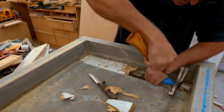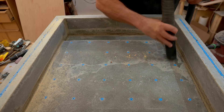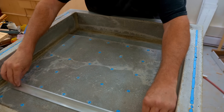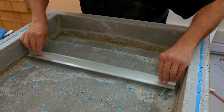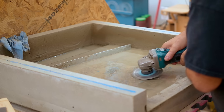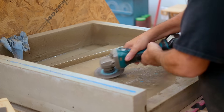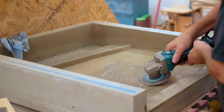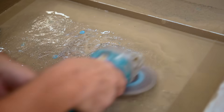In the first video I alluded to a mistake with the formwork — I didn't support it properly. Here's where I found that out: the bed isn't flat. It's actually humped up because the weight of the concrete was too much for the five-eighths-inch melamine and it pushed down. I didn't expect that or think I'd need more bracing. It's not that bad — I could screw down a spoil board and flatten it — but I really prefer the base to be closer to flat to begin with.